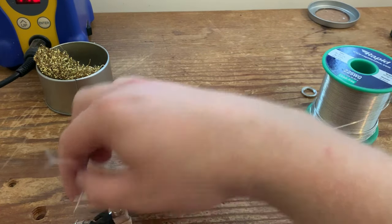Right, so nice and simple to put in. When you're working with a braided wire, it's exactly the same situation as with the switch. You've got the inner cloth wire and the outer braid. The outer braid is the ground, which we need to ground to the top of the pot casing here, and the inner cloth wire of each pickup is the hot signal, which we're going to solder into the volume output lug. That is the one with the yellow wire and the treble bleed.